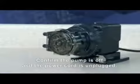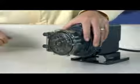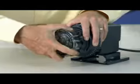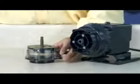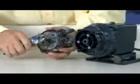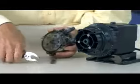To remove the pump head, hold the feed rate securely. Grasp the head and turn it clockwise until it stops. Remove the head by pulling it straight out from the pump. The main shaft will come out with the pump head. Using a pair of pliers, grasp the main shaft and rock it back and forth, clockwise and counterclockwise, while pulling it straight out of the pump head. Set aside the shaft to be reinstalled later.